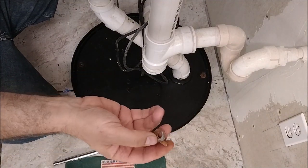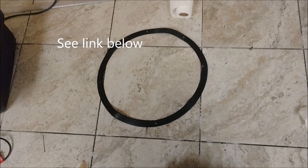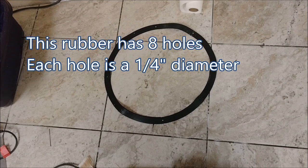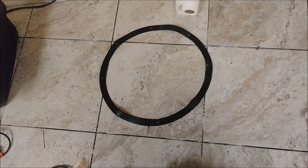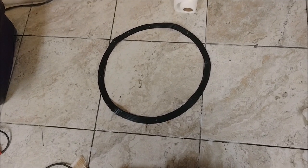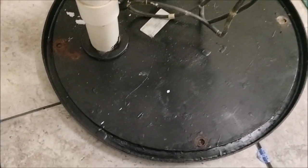That is another screw here — same thing. I'm going to continue removing the other two screws. The sealer I purchased from Amazon — I can put the link there — and this sealer should resolve the issue. As you can see, this rubber has eight holes, so when you put this rubber between the cover and the sump pump you will need to align the holes to the holes in the sump pump cover so the bolts will go through. You can see how I can move the cover very easily — I'm going to put this rubber slowly and surely between the cover and the sump pump.